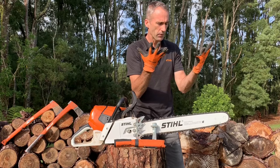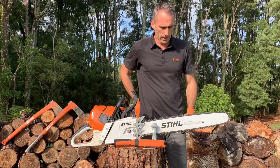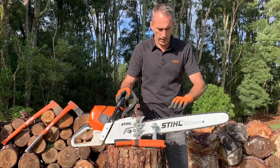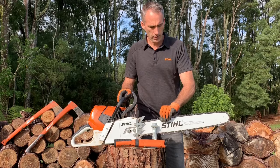You'll notice that I'm wearing gloves — it's good practice, especially when working on a full chisel chain like this, as it's pretty easy to cut yourself. When working with a chain and turning it over, pull from the top away from the saw. Don't grab the chain and pull back that way, because if you slip it's really easy to cut yourself.